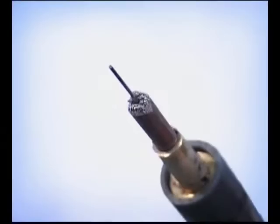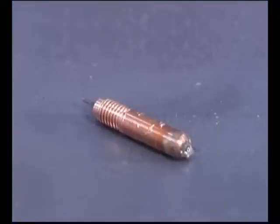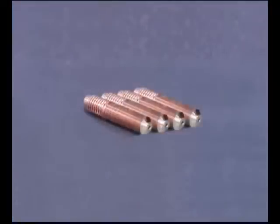During the weld, small bits of hot metal called weld spatter fly out of the molten puddle. Depending on how clean the metal is and the position of the weld, globs of spatter may stick to the end of the contact tip. Occasionally, check the tip and scrape off any buildup. The wire can also burn back and stick at the tip, so it's a good idea to keep a few extra contact tips on hand.